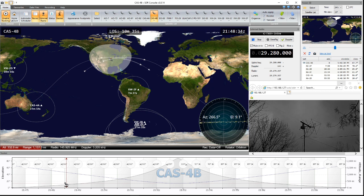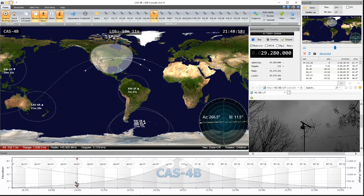What I'm going to show you is how the 7300 works now with the transverter. To do this, for an uplink you need a 435 transverter — I have one coming from Ukraine. I have a two-meter one here already, which is superb, a great little piece of gear, really really good stuff. Spot-on frequency right out of the box, which I can't say for the 857 — it's off frequency.